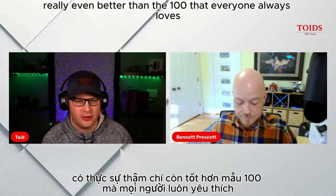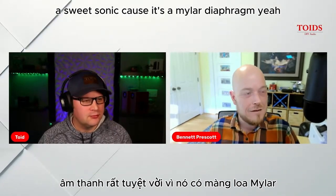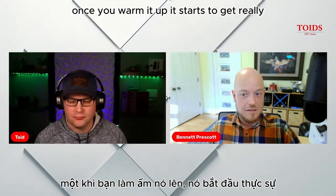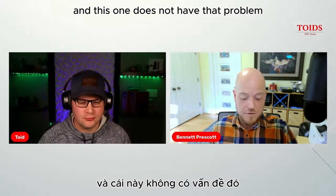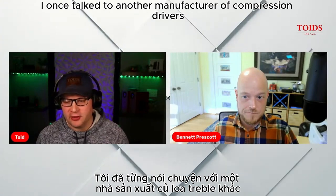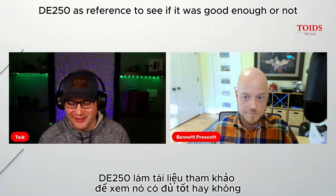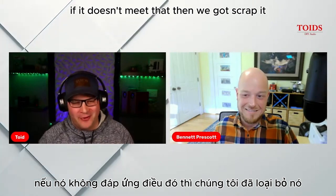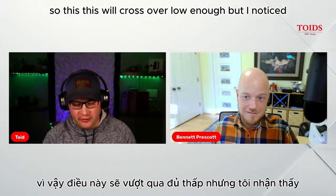It's a part for pro audio, like everything we make, providing solutions to pro audio OEMs in terms of compactness and cost. But what I really like — especially relevant to the DIY market — is that I think it sounds better than any compression driver we've ever made, even better than the DE250 that everyone loves. The DE250 sounds really nice at low levels with a volt or two — it's sweet-sounding, it's a Mylar diaphragm — but once you warm it up it gets really distorted at pretty moderate levels. This one does not have that problem. In fact, another manufacturer told me they used the DE250 as their reference benchmark.